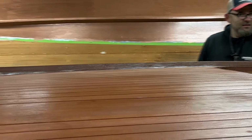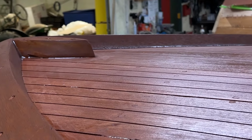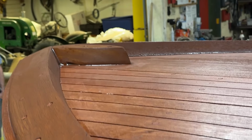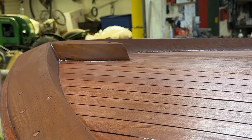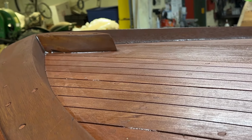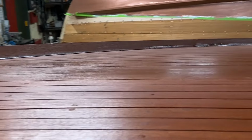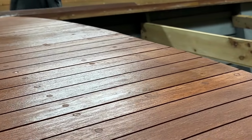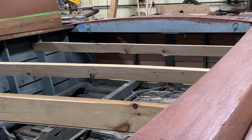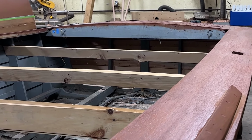Yes. So we will flip her over. She will receive the Snake Mountain Boat Works True 5200 alternate bottom, 2 layers of Meranti plywood, and of course with the 5200 and the CPES, as well as 5 coats of barrier coat, Interlux 2000E, and we'll finish her off with 4 coats of Pettit hard racing copper bronze bottom paint.